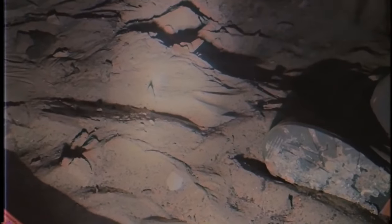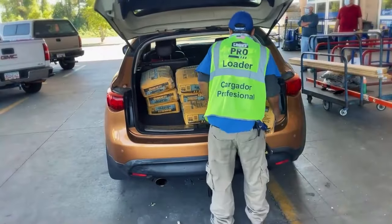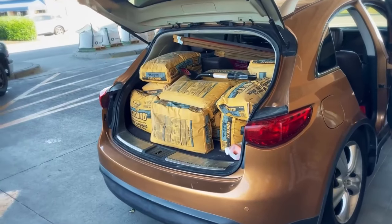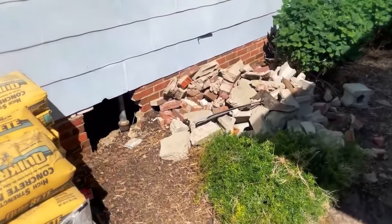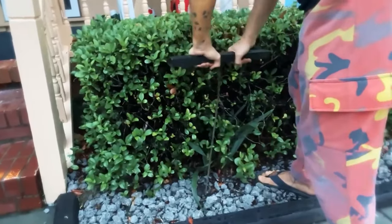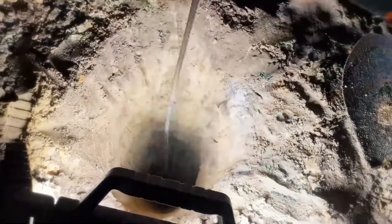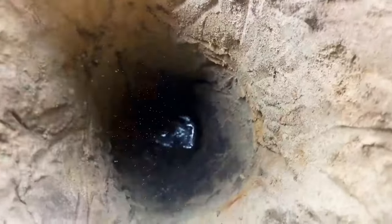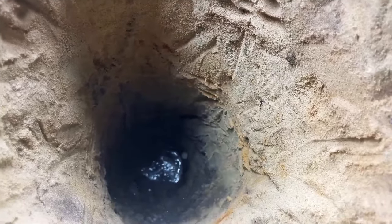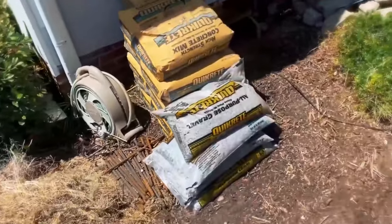Don't sit piers on the ground or the slab directly on sand — never, no matter how hard the ground seems. One cause of a house sagging is that piers sit on problem soil that isn't strong enough to support the structure. Some areas have soft ground; in others, the water table can be too high. If the property is close to natural water, the underground water level can depend on low and high tide. You must have piers built on concrete slabs, not on sand or bare ground.